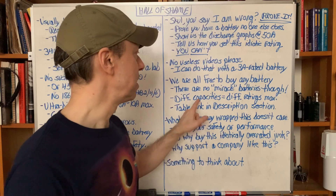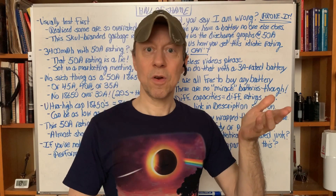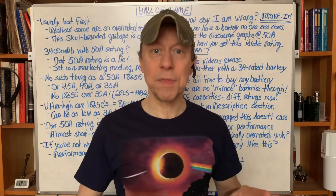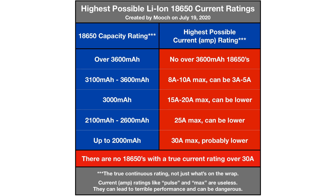Something to remember: different capacities have different maximum ratings. As capacity goes up, in general, the current rating goes down. These ultra-high capacity 3100 to 3600 milliampere hour 18650s are going to have the lowest ratings of all. I'm going to show a table on screen — there's also a link in the description. First and most important: there is no 18650 rated over 30 amps. For capacity, there is no 18650 rated over 3600 milliampere hours — really the highest is 3550, that's the Panasonic 18650G. From 3100 to 3600 mAh, the maximum is 8 to 10 amps; it can be as low as 3 amps.